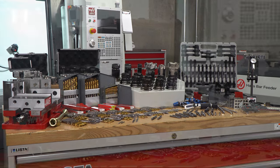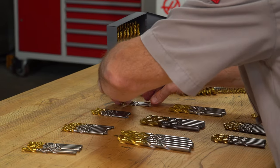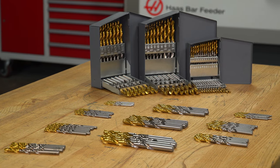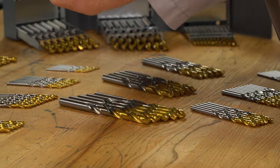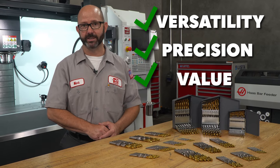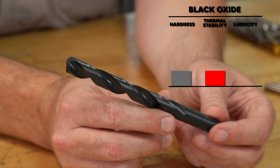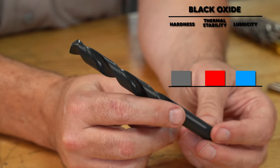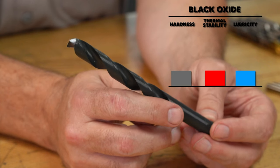These are not the kind of tools that we will find in our local hardware store. Drill bits might be the only tools on this table that your average person on the street would recognize, but these are not your average hardware store drills. We are looking for versatility, precision, and value in a starter drill bit set. Black oxide finished drill bits are not going to be our first choice — while they work fine on mild steels, they just won't hold up against tougher steels or any type of nickel alloy. They also tend to gall up when run on aluminum, so definitely not our first choice.